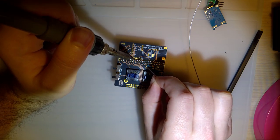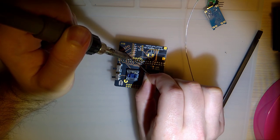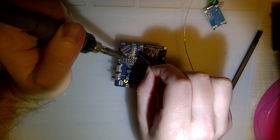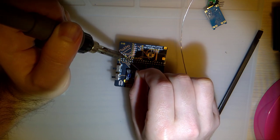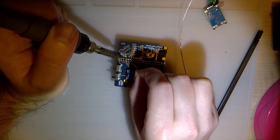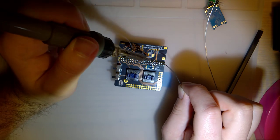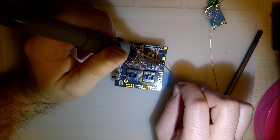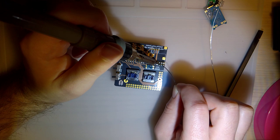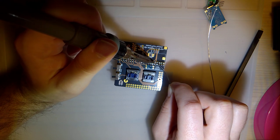Now, it's not too tremendous a big deal if these solder joints don't work out too well, because thankfully I can touch it up from the top. But if these don't work, then the Arduino is going to have trouble interfacing with the LCD or the micro SD card or the OLED screen or whatever. But it should still be able to read the actual cartridges with zero issues.